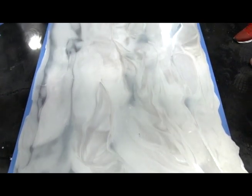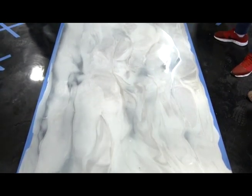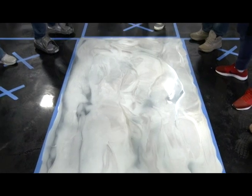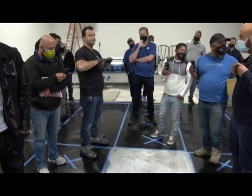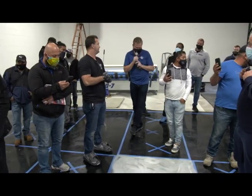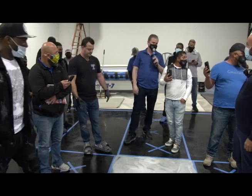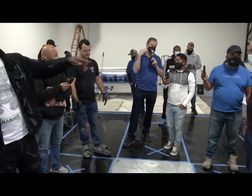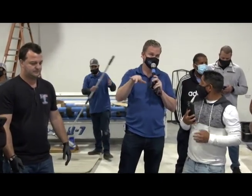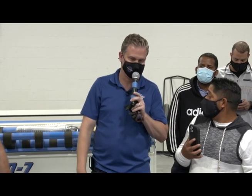Pieces of what's it called? Weather stripping. Yeah, it's weather stripping for campers. If you go to Home Depot or Lowe's, it's great. It's like $5 a roll, but you double stack that and it won't roll over. You've got to create a dam. We use weather stripping, usually in the window and door department, to create dams, especially if the driveway or the garage is sloping in or out, because water runs. You're going to want to dam that in, and a lot of times we'll double stack that. Weather stripping is your friend. We use it all the time.